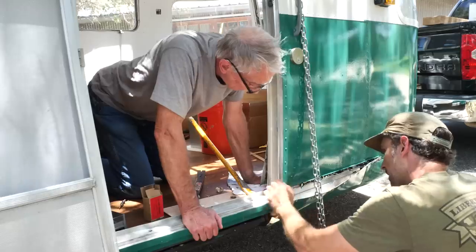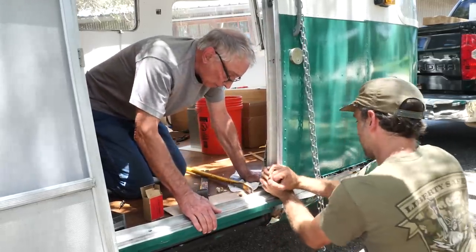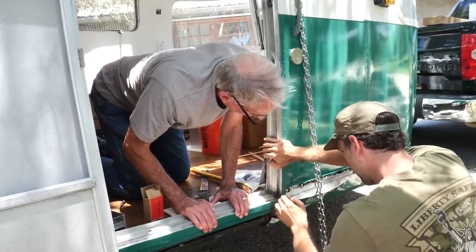And I didn't have any screws in there. I hadn't put those in yet. So with something in there, it would keep that door frame from sliding out under the weight. So I put a pretty sizable screw into that. It went down into a frame material. And that screw was able to keep the frame from kind of wanting to buckle outwards as we let leverage off, and held everything in place.